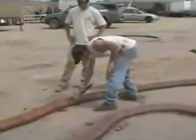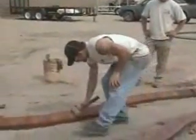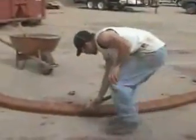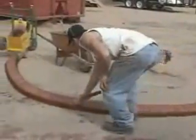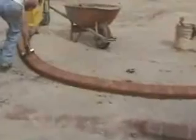Alright, you're up, Cliff. And there he goes with the diamond roller. This one he doesn't lift at any stage. It goes all the way to where the machine is, and it sits at the front of the machine, and then he would continue on doing more curbing using the release. He lifted it off there. He should have left it right there, because if he was doing another 30 feet, then he's got to find the pattern on that stamp. Generally you'd leave that roller right up the front.